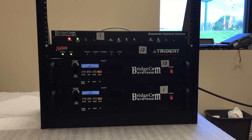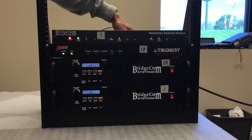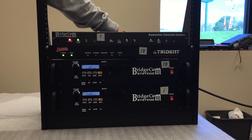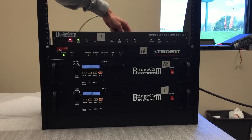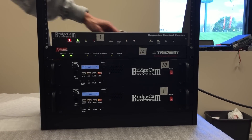As you can see, the sync LED is lit on both controllers. I'm going to pull the bus card from the Raider and you'll see that the sync goes away, and then I'm going to put it back in and the sync pulse returns.